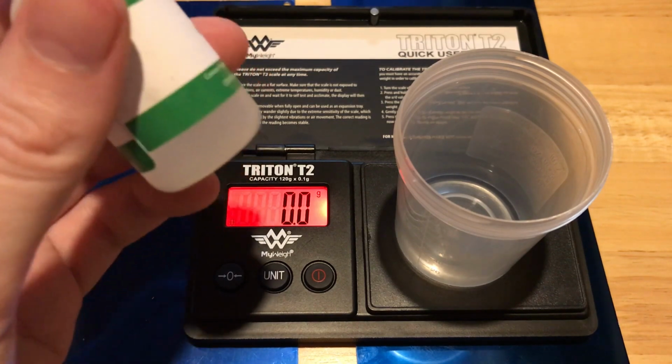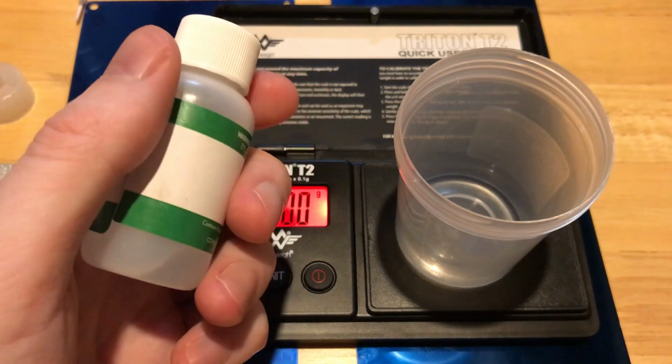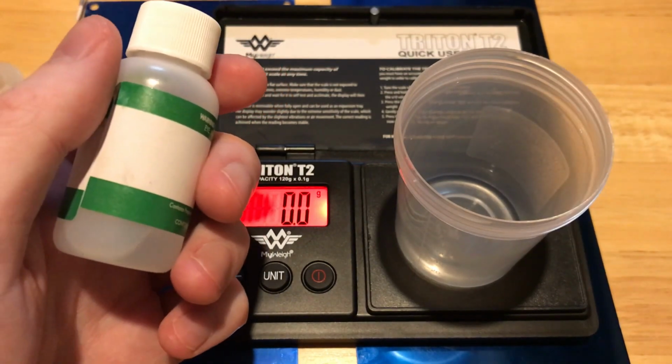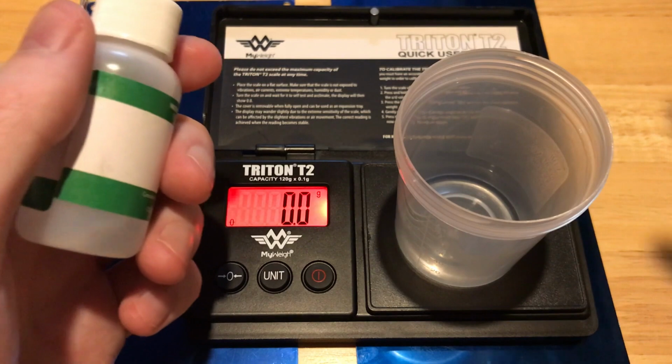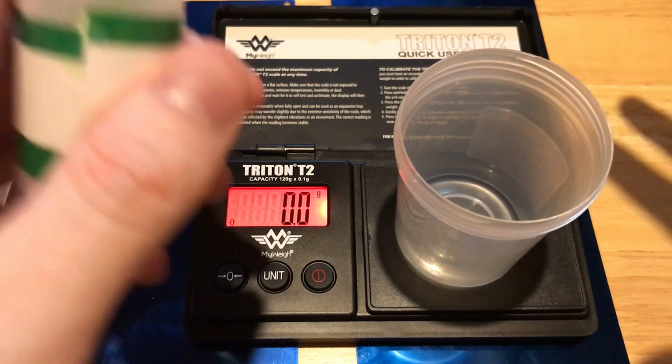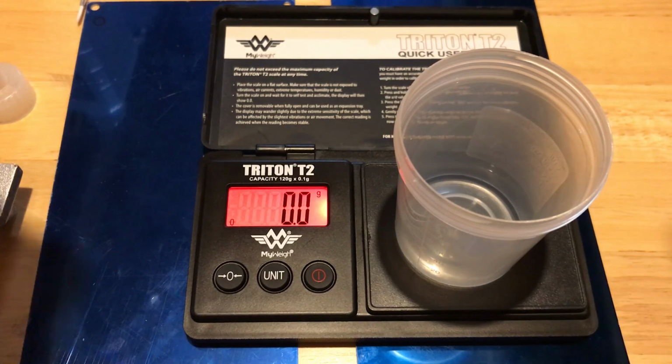It's extremely tedious, but once you get it right, you'll notice because the pad will pick up the ink without any problem, transfer it without any problem. It's just finding that right mixture of paint to thinner so that it's got the right viscosity to be picked up by the silicone pad and transferred to the dial.